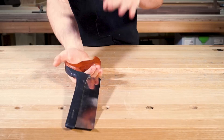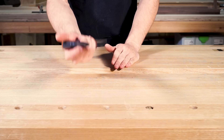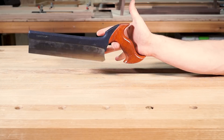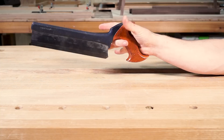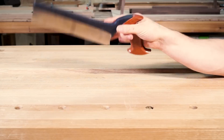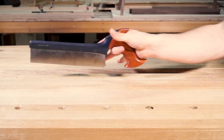You don't want to be giving this a death grip around the handle. You need to hold it with firm enough pressure that you don't drop it, but not so much that you start cutting off the blood supply to your fingers. You can actually hold the saw with just one finger - the bottom of the handle is gripping on the underside of your hand, the index finger pointed along the spine gives forward motion, and that hook at the bottom takes the weight of the saw plate. So you could actually cut wood like that if you really wanted.